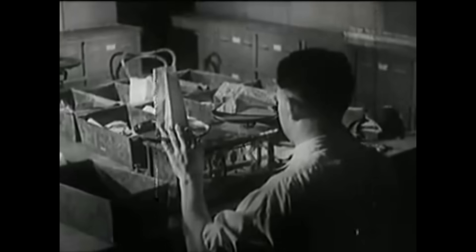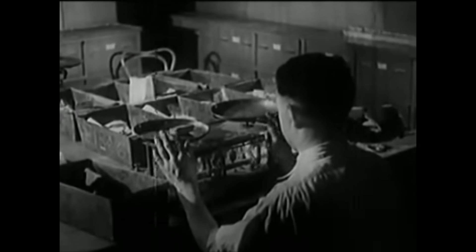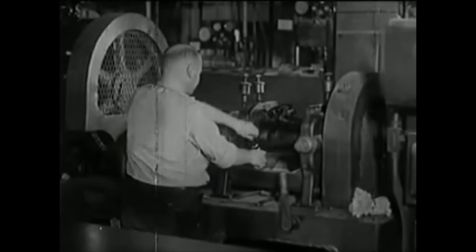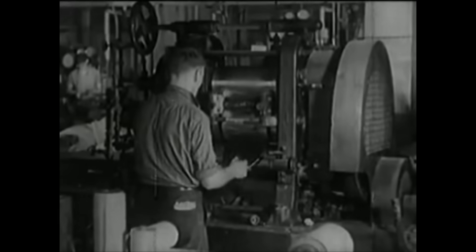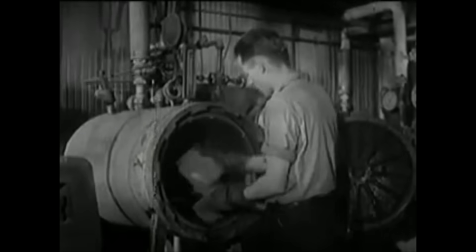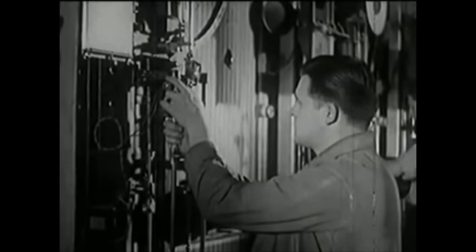In the research laboratory, there's a constant quest for better than best. Day after day, the search for new developments and product innovations is diligently carried on. Anticipating the needs of tomorrow, new formulas and new compounds are developed in a miniature factory — toy-like in comparison to the huge equipment of the plant, but exact in detail, with Banbury mixing machines, mills, calendars, and vulcanizers. Here, small experimental batches of rubber are carefully compounded, mixed in miniature mills, rolled into sheets on small calendars, and cured in tiny ovens. Samples of these cured sheets of rubber compound are tested for their strength, stretch, elasticity, and resistance to wear.